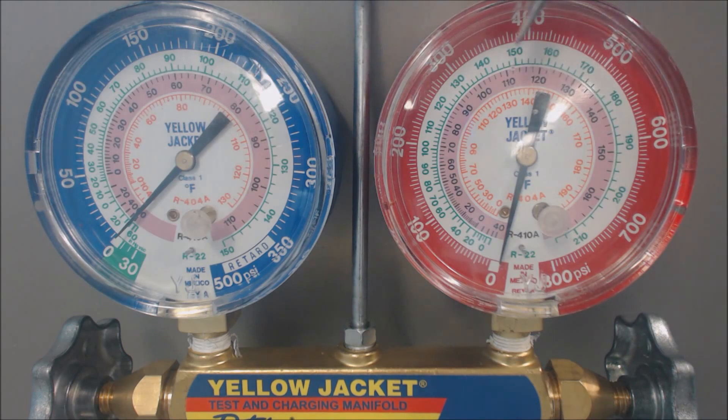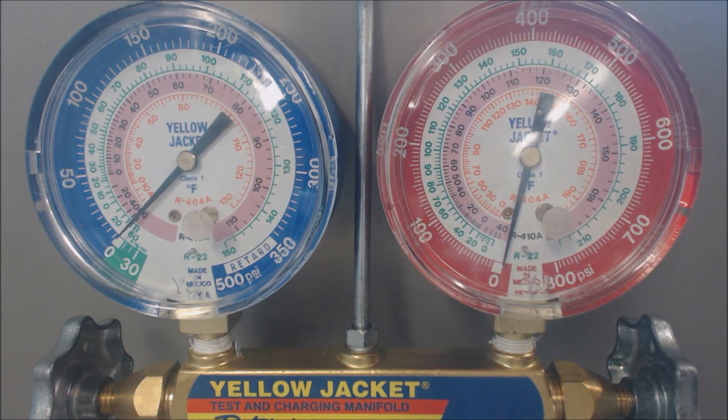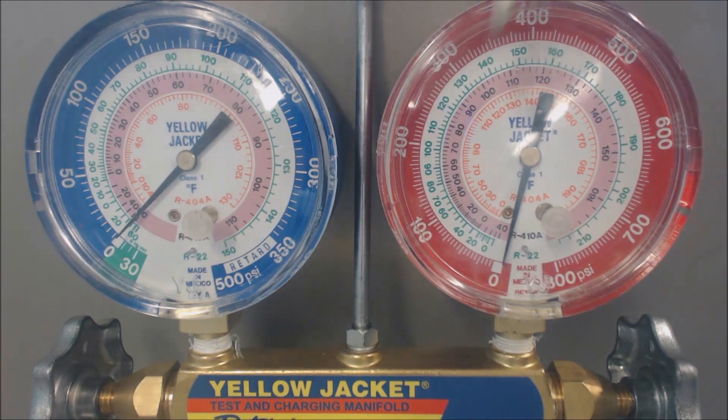So 143 degrees could be caused by excessive non-condensibles in your refrigerant line — there could be some nitrogen or air in the line. The more common thing you might see is that the fins are worn out. When the fins deteriorate, especially if it's near a beach, the salt air really erodes the condenser coils, and then you have high discharge pressure. The higher the discharge pressure, the less efficient the system is.